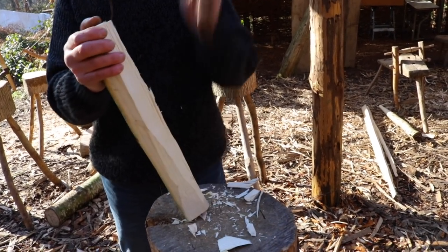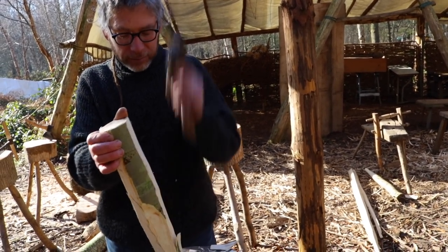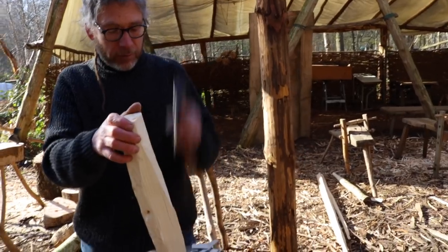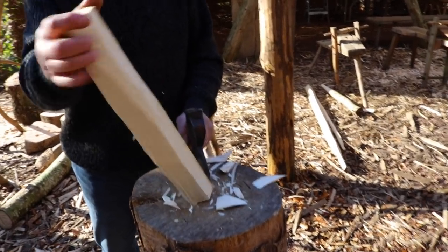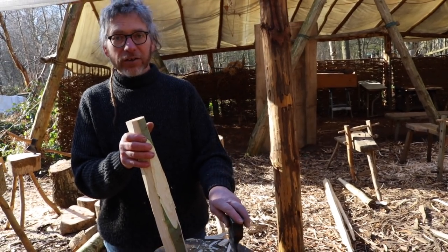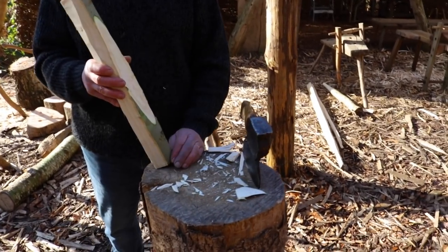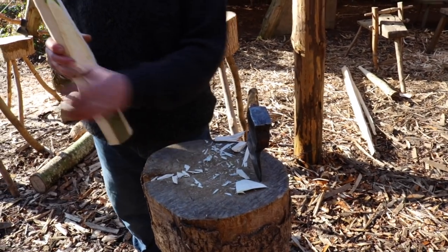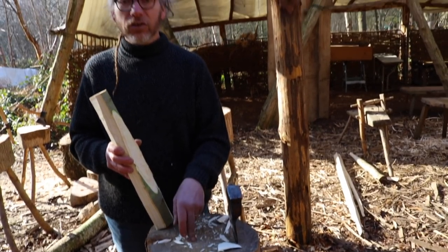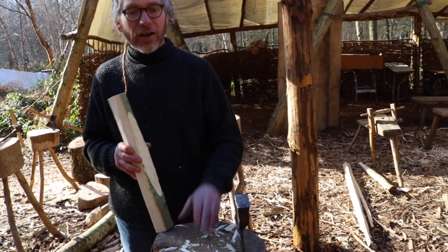Is it also important to make sure you have no pith? If you're using cleft timber, the pith is the weakest part — there's no strength in it, so we get rid of it. It sort of naturally happens when you're cleaving and bringing it down to a cylinder. When you're finished, bury your axe in the chopping block to keep it safe or put a cover on. One other tip: when you've got your chopping blocks, cover them when you're done. On a dry day, dust blows into the top of the chopping block — that dust is abrasive, so when you put your axe in, it creates little chips in your blade. Look after your chopping block and it will look after your axe.